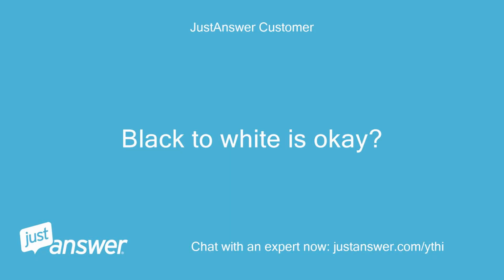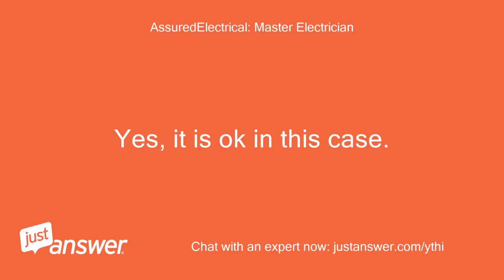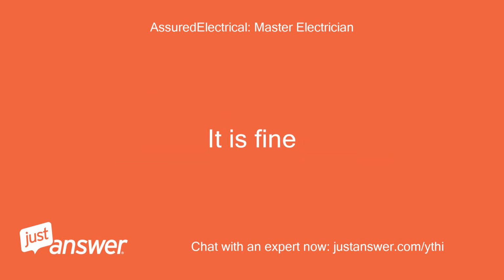Black to white is okay. No fire concerns. Yes, it is okay in this case. One of the blacks off the fan should have had a white wire crimped to it at the factory. The black you are connecting is neutral because the fan runs on 120 volts. It is fine.